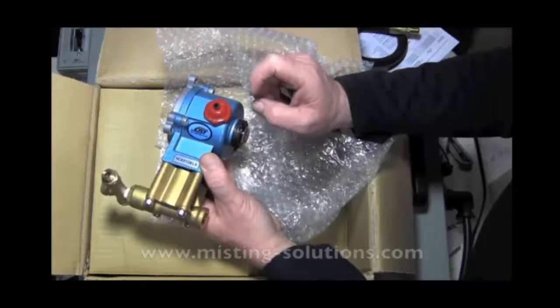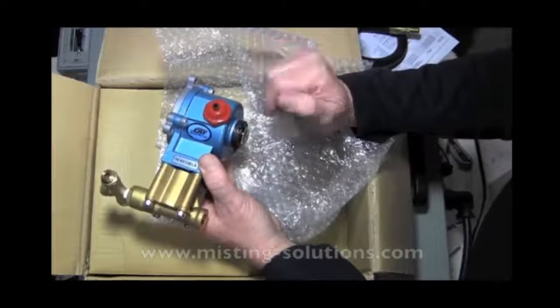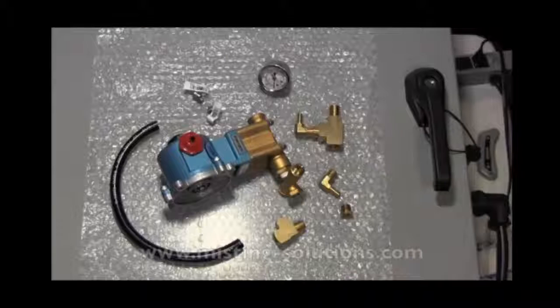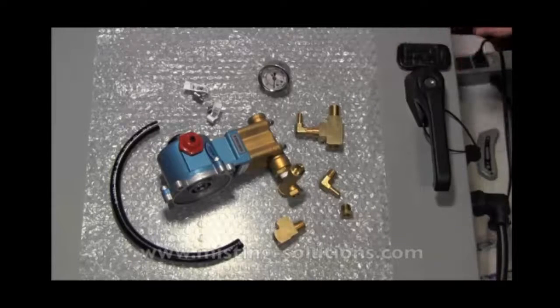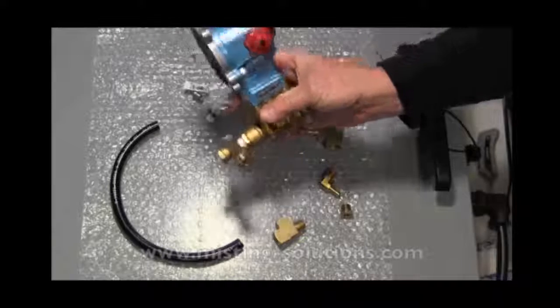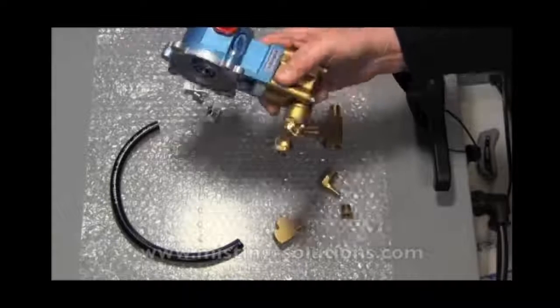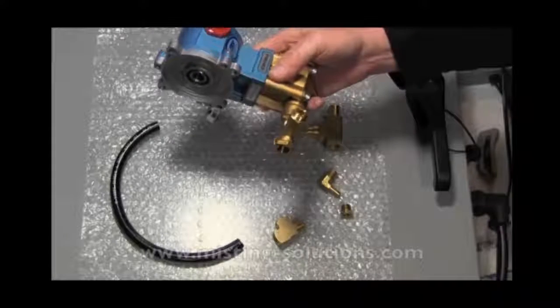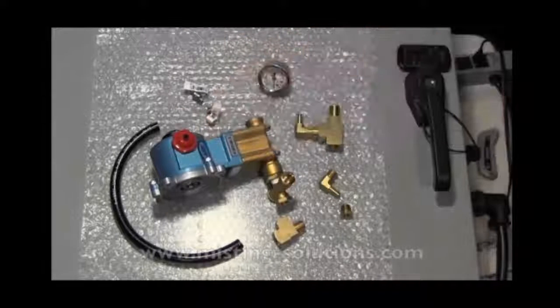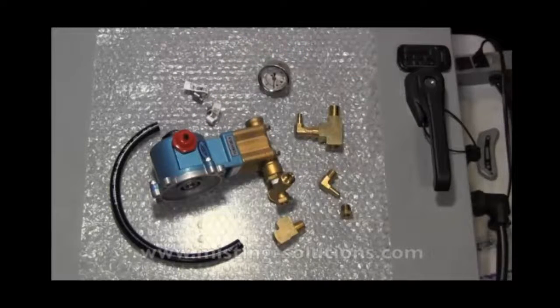That plug has to come out after shipment, just like a pressure relief or pressure regulation valve. When you get this CAT pump — the 1CX013ELS, the smallest that CAT makes at 0.13 GPM — all you get is the pump itself. But in the manual, they'll talk about providing a wraparound bypass and maybe putting a gauge in it.